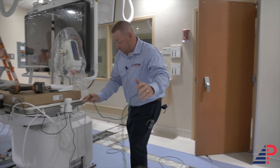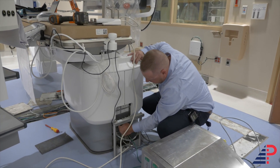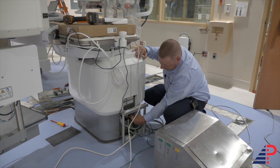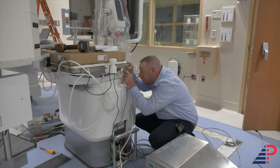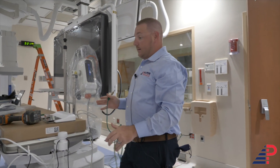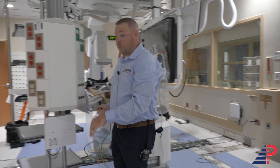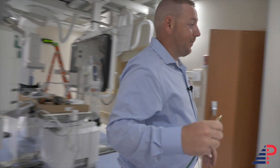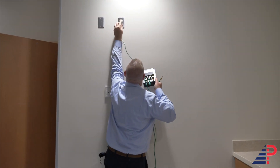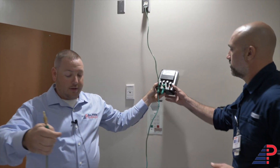On the bed itself, come down to the ground ports on the back — touch that ground port and make sure it's grounded properly. Come up underneath the bed and there's a metal screw — test it. Anything likely to become energized: since there's electric attached to the bed, it's likely to become energized. Once we're done testing all of that, we'll disconnect from critical and plug into a normal receptacle. Make sure it's nice and tight, then do the same thing again based off the normal receptacle.